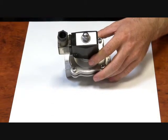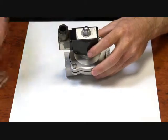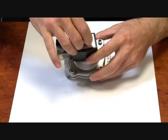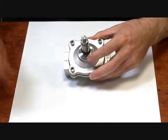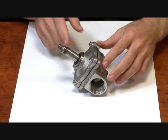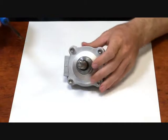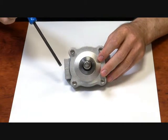Now if I just take it apart to show you how it works. To remove the coil, just undo the top bolt. Here we have the valve without the coil — it's got the operator stem here and the body of the valve. It might be easier now to see this arrow which is moulded on the lip of the valve — that's the direction of flow arrow.